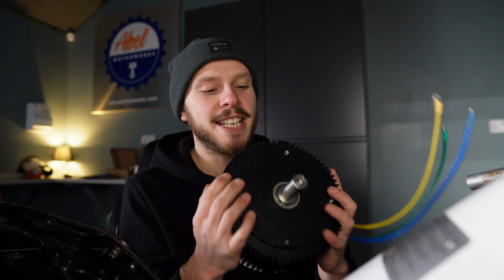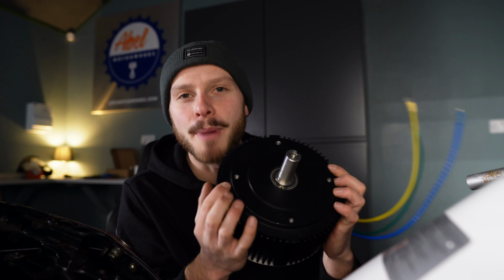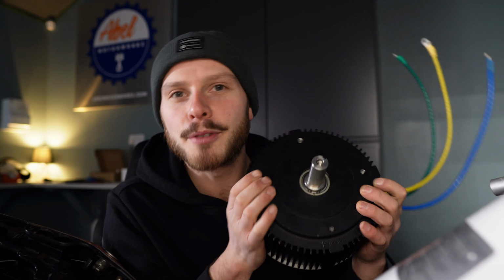So now I can offer up the battery and motor into my frame. But what motor did I go for? This, a 5kW continuous DC brushless motor from Golden Motor. There's a couple of reasons I went for this size, and that's all down to the aims of this project. I want a bike that'll do a maximum of 60 mile an hour and will hopefully have a range of 100 miles when two batteries are fitted. So this 5kW sustained motor has a peak output of 10kW, which will give me that maximum speed of 60 mile an hour.